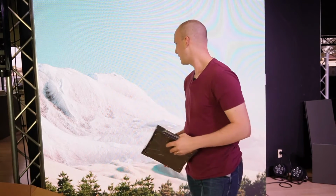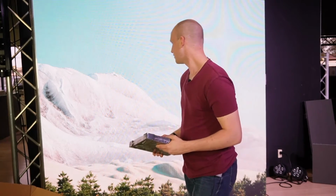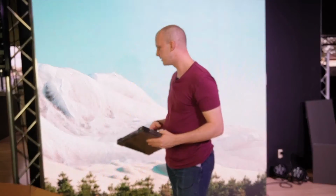Now, they can be changed out with either a suction tool or a magnetic tool that you can purchase separately. They are actually fairly pricey, okay? And with the tool, you're able to grab the module and pull it out. Some are front serviceable, some only back, and then place the new module back in.